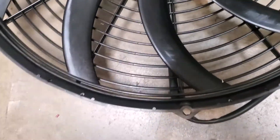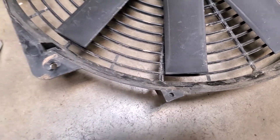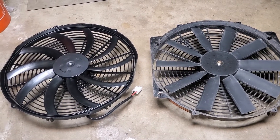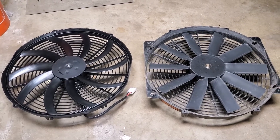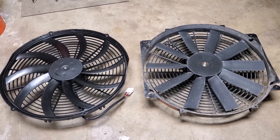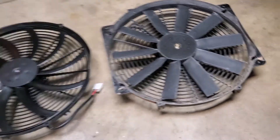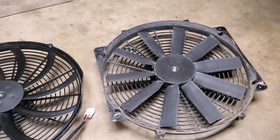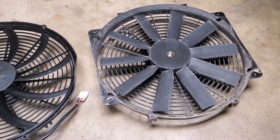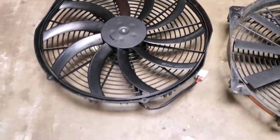All things being the same, a fan with a really close gap would perform better than one with a really open gap. I used to work on turbine engines as a mechanical engineer doing sensors and testing, and blade tip clearance is one of the most important performance parameters for a turbine engine — and the same goes for regular fans. The closer the fan is to the outside of the shroud, the smaller the gap, the less air can make it from the high pressure side around the end of the blade to the low pressure side, causing inefficiency. A tight fit, or something to totally block that air from getting around, gives you a more efficient blade.